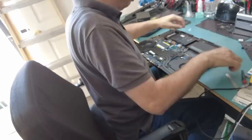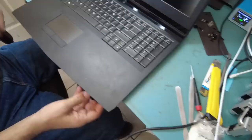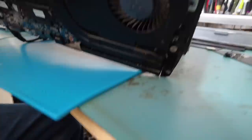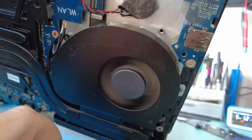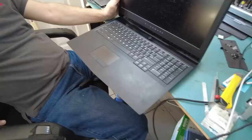Big Boss is done with the reassembly and I told him he can reassemble everything because we're not opening up this laptop again. I'm not working on the motherboard again. So let's see — we do see the light, the red light came on but it went back off. We're going to have to check the fans. Are the fans spinning? No, the fans are not spinning. Same thing — spinning and stopping, spinning and stopping. That's it. The problem is likely the CPU. If we can end the video right here, I hope you enjoyed it even though it's a no-fix. Don't forget to like and subscribe. Leave a comment if you have any questions and we'll do something else in the next video.